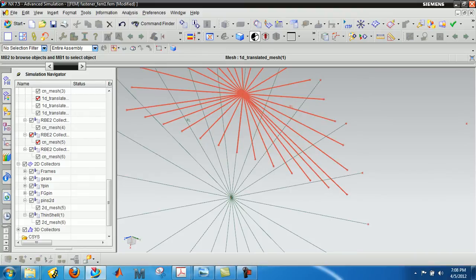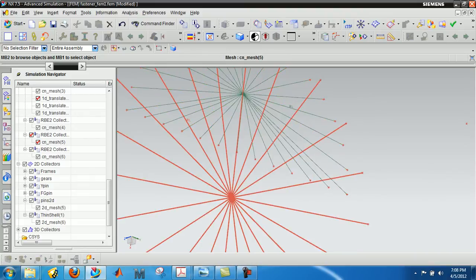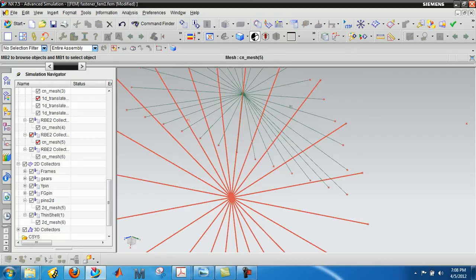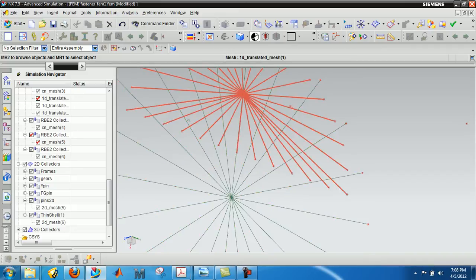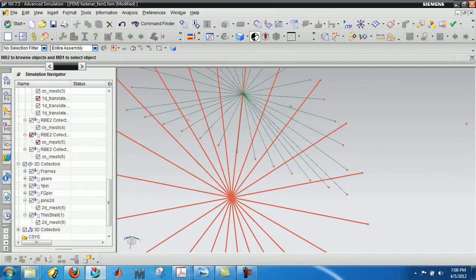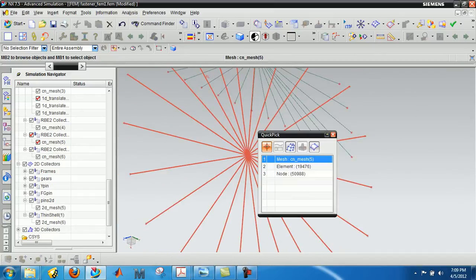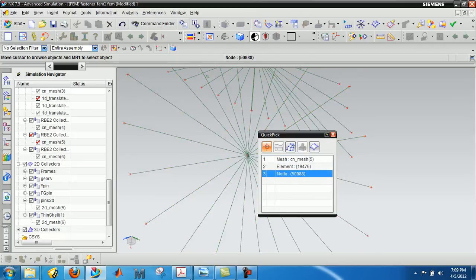So you have this spider and this spider both going to two different nodes at the same point. And in between those two nodes, we're going to connect them with a C-bush. A C-bush allows you to define the stiffness in all degrees of freedom, and that's how we're going to allow rotation of the pin spiders around the big frame. We need to keep in mind that there are going to be two nodes here, so it's a good idea to mark down the node number.